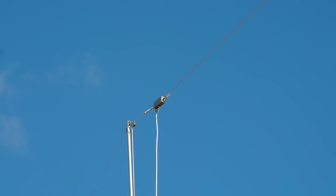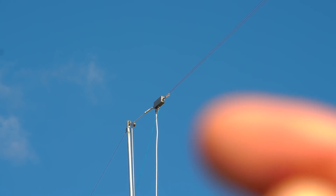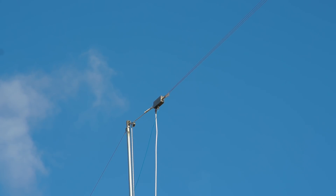There's a bunch of little loops right where the wires come in — because the lens is so zoomed in, my finger looks fuzzy — but there are little white loops right where the wires come in. That's where it's soldered to a tab behind the actual eyelet. The wires themselves are wound around the eyelet, but they're not soldered to the eyelet at that point, so that allows movement there. There's a bit of strain relief through those little white insulated wires, and then it runs back to a tab where they're soldered to the backside or threaded portion of that eyelet, which runs inside the box. There's also a blue lead running down that I haven't hooked up yet — that's just the common — and I'm going to cut that to length and maybe tune things a little more using my VNA to optimize this antenna.